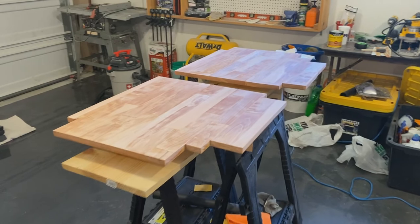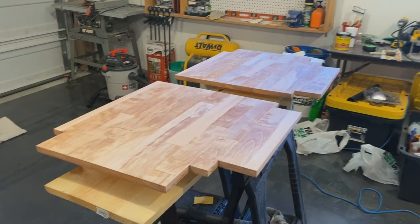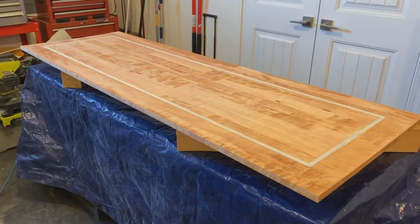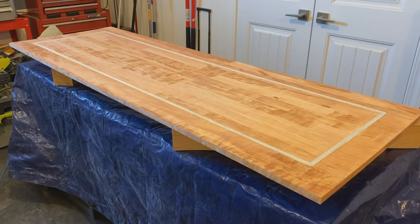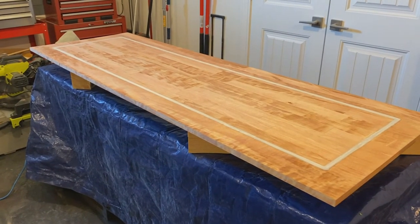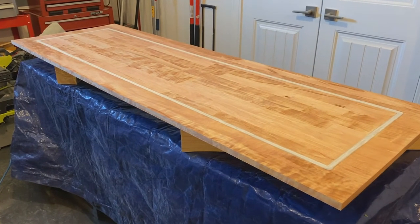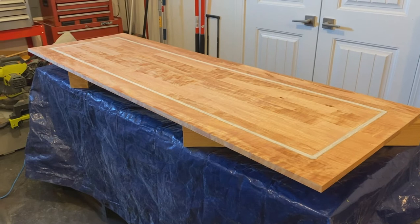And once you do that first coat and every coat in between, so it's a little different than stain. Stain, you wait 2 hours between coats. On polyurethane, you wait 4. So it does take a long time to do 5. It usually takes about 24 hours, 20 really, if you think about it. So there's some getting up in the middle of the night if you start it in the middle of the day. It's fine though, I don't mind. It takes about 10 minutes to add a poly coat.